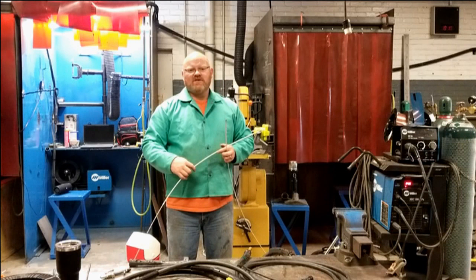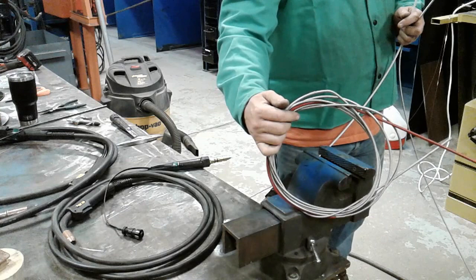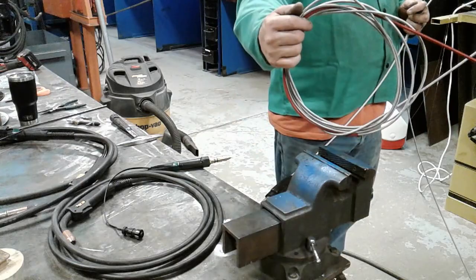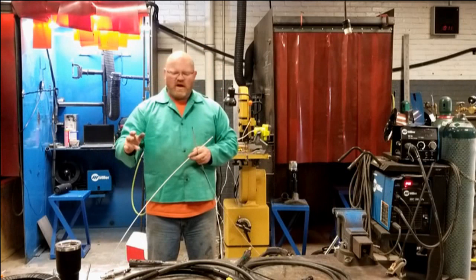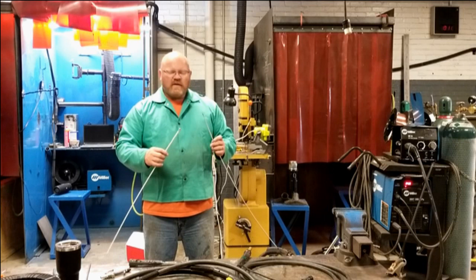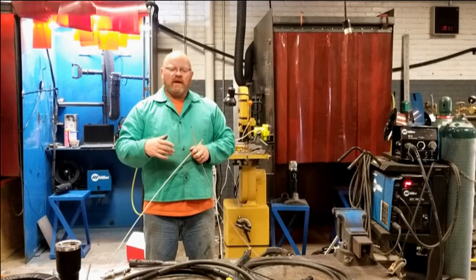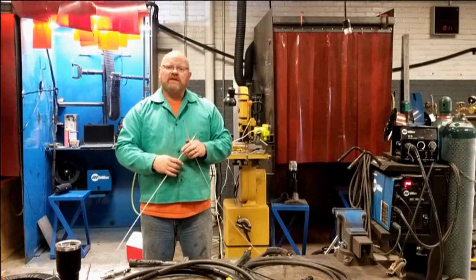This is an analogy for what happens to your MIG gun liner. When you have a liner that's damaged — and I have one right here — you can see there's a distinct kink that's not going to come out. That liner will become extraordinarily difficult to use. These aren't very expensive, around $9 or $10 a piece, so they're not worth trying to straighten. You can physically damage them by coiling the gun too tightly, or by yanking on it to get a loop out instead of rolling the gun to unravel it.